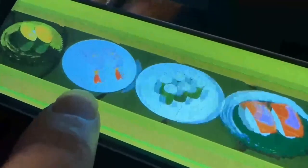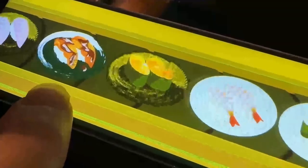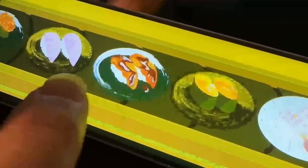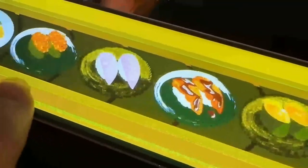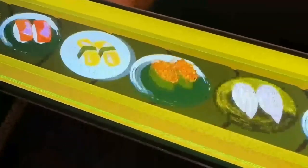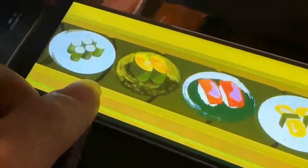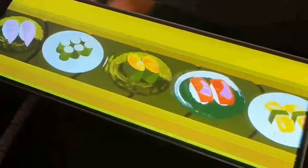That's because the code that I'm using only has one single buffer. And so when it draws the JPEG, it decodes it onto the main frame that's also being displayed. And so as the animation goes, you're going to see this flickering effect. Double buffering will help there. I also think there's a little bit of destabilization in the V-sync and H-sync pulses.